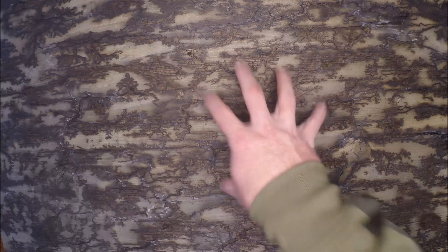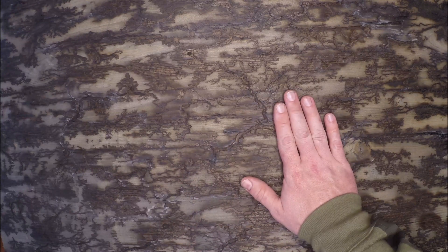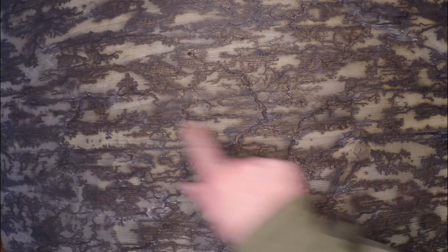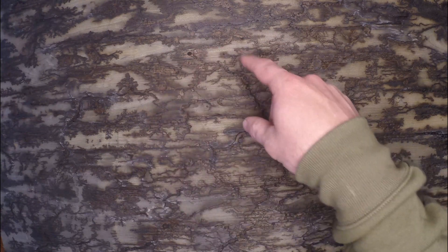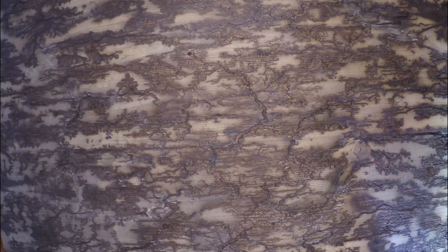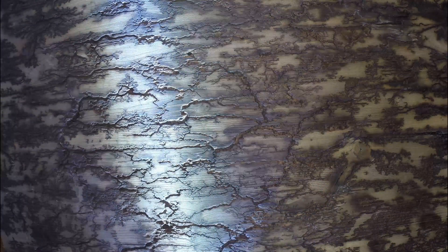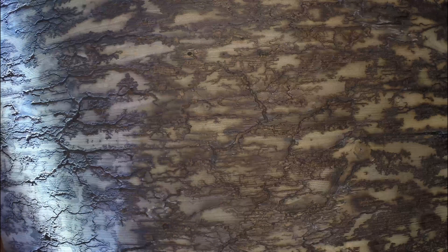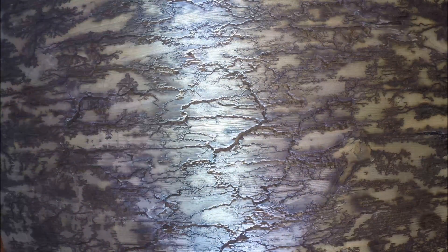Using this little broom to make sure we don't have any carbon coming up the sander. It's basically just wood and charred wood at this point. Once we sand it down it's going to give us a lot more contrast. I want to show you guys the depth of these grooves — the best way to do that is to pass a light along at about a 20 degree angle instead of using a top-down setup, because right now you don't see any of the shadows. If you add in an extra light source like this, shadows are generated by any change in contour. This is a trick I learned from an old tracker I used to work with when trying to find human or animal spoor or sign.